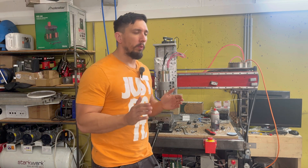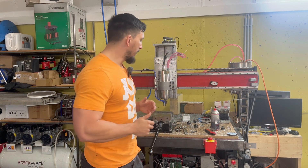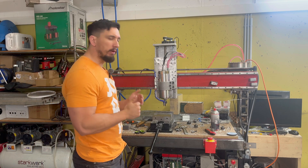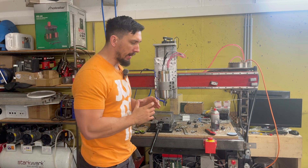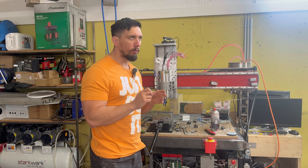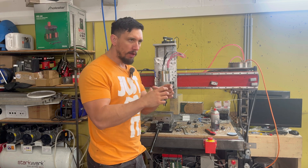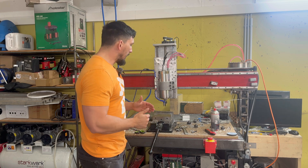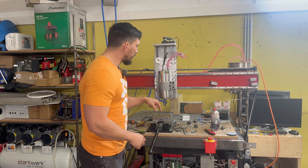What's going on y'all? It's Dom here with Still Nice CNC. So today we're gonna have to realign this whole machine. The reason why is because when I was creating an external nut shape with an internal thread for an M45, I had an extra cut parameter. It went forward and just dug straight down — the z-plate is completely cockeyed.